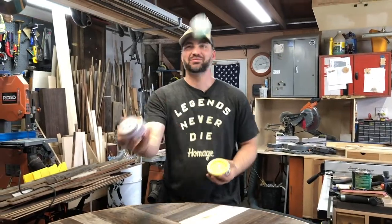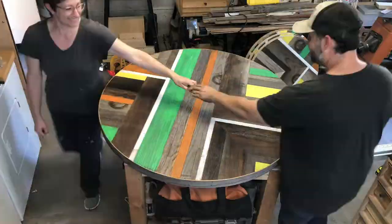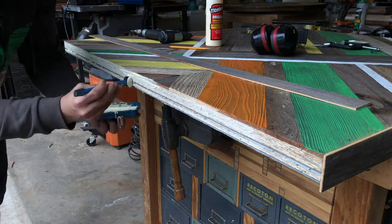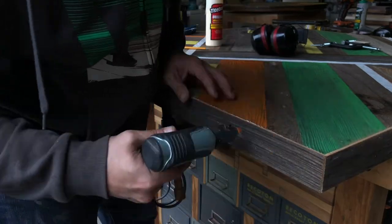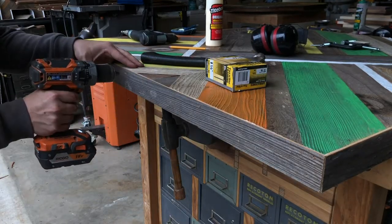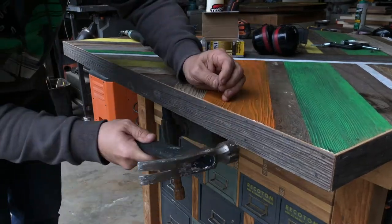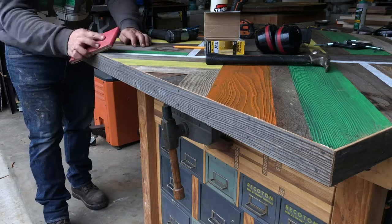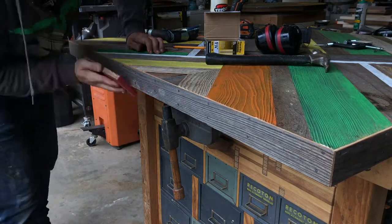Now it's time to add a pop of color to these tabletops. Dealing with the trim on the square tables is really pretty easy — since it doesn't need to be bent or curved, I can just take the wood as is and rip it down to the width I need, then lather it up with some glue. I'm going to use pin nails to tack it in place so it doesn't move around. After that, I drill some pilot holes to keep the wood from splitting when I hammer in the nails, which also fits the rustic vibe. Finally, I'll break the sharp edges of the rustic wood, which keeps my hands from getting splintered and helps the epoxy flow over the edge better later.